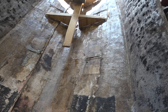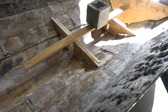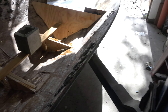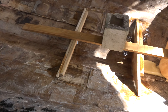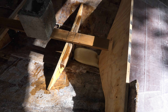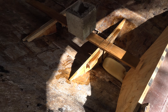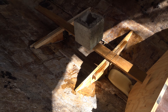I'm also gonna fill all the space underneath the floor, just like I did in the front, with self-expanding closed-cell foam. Number one, for flotation. Two, to keep moisture out. Three, it makes it sturdier — that stuff is pretty dense and quite sturdy, and it definitely keeps the moisture out.